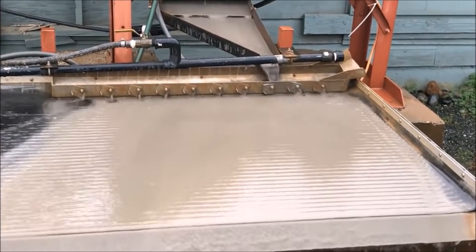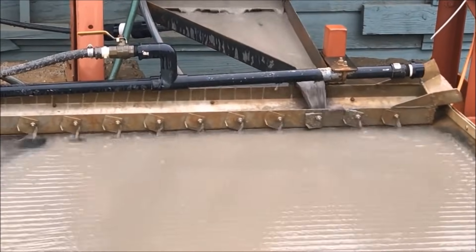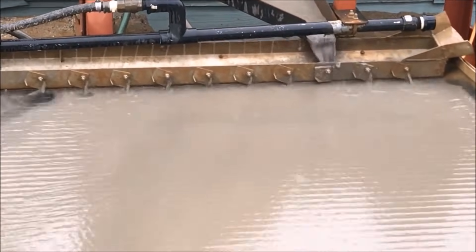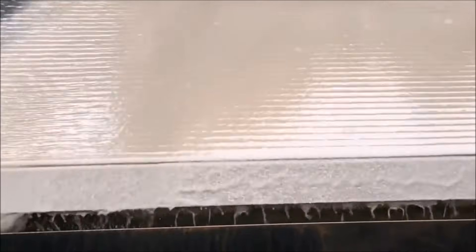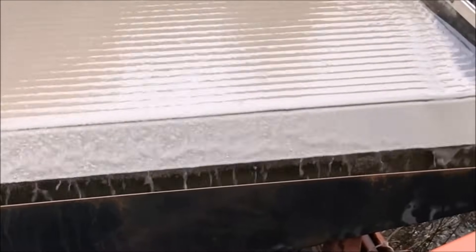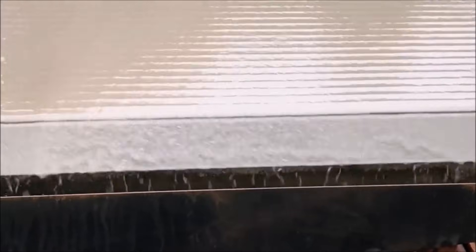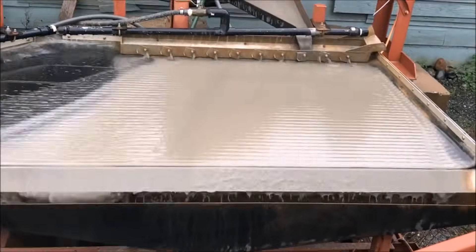The distributor trough is tuned so that the ports are evenly feeding across the entire shaker table surface. There is a nice even flow over the grooves — there's no rivers or rapids on the shaker table top, and it's all a fairly even drip across the drip lip going into the number four tailings trough. You really don't want to have any rapids or areas that have a higher flow than other areas.